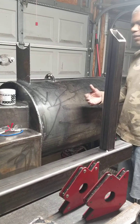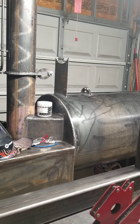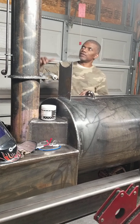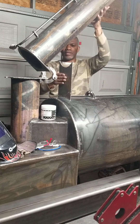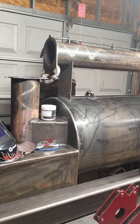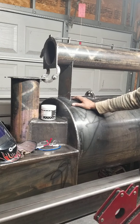I also did a little hinge on the smokestack — and the reason I did that is because this stack is pretty tall and cannot fit out my garage door. So I did cut my stack and hinged it, welded this little brace on, so that now I've got a folding stack, and that'll enable me to get this out of the garage.